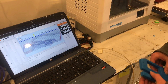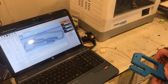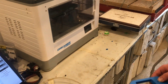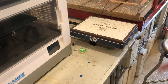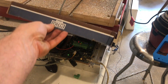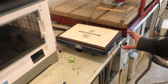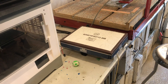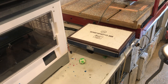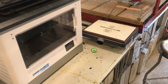The router CNC controller software I use is called Universal G-code Sender. It's one of the more popular control packages for working with an Arduino-based or Grbl CNC machine — which I have covered up right now because of all the aluminum chips. You have to make sure aluminum chips don't fall onto the electronics, since aluminum is a conductive material and it could short things out and damage your controllers.